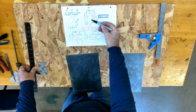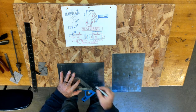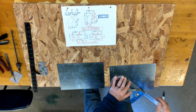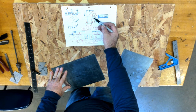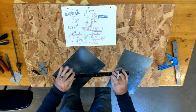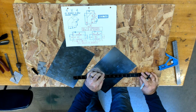So next I have to carry my 45-degree angle. I'm just using a combination square. I'm going to connect to that inch section and draw my 45-degree angle. This angle line is going to be measured four inches, because we're doing a four by four with four inches on both sides of the throat. You would match that dimension to whatever your throat dimension is — we're just doing everything in fours.